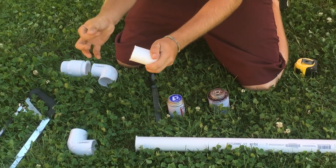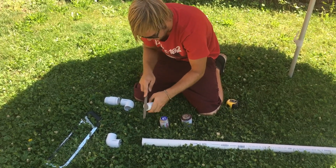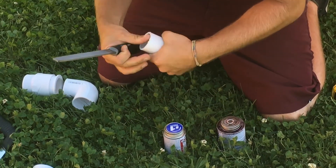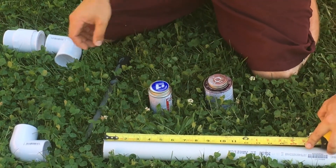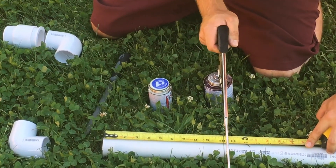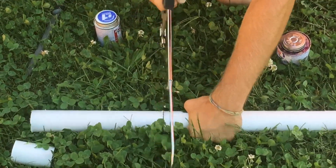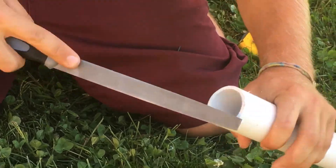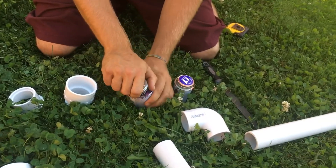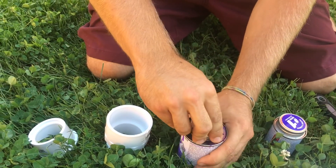I'm cutting fittings here to put together a converter from my irrigation pump into the pipe system. Not every irrigation pump is the same — the fittings will be different. Mine happens to be an inch and a quarter going into inch-and-a-half pipe. If you're coming from a regular garden hose, you want to use a three-quarter inch hose bib into PVC and probably a smaller diameter pipe to get more pressure. The bigger the pipe, the lesser the pressure. An irrigation pump pumps a ton of water, so inch-and-a-half is fine.